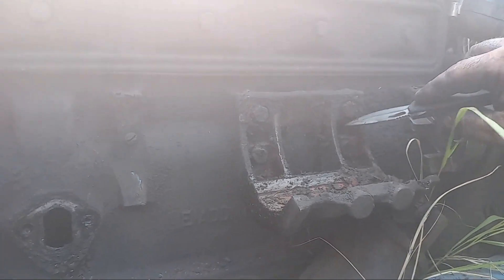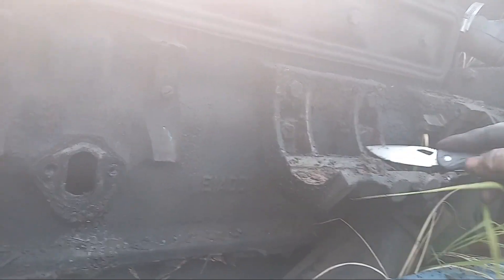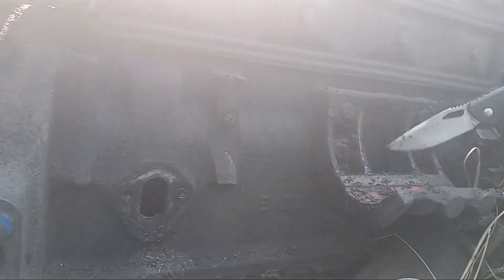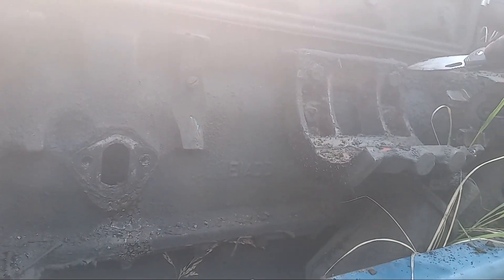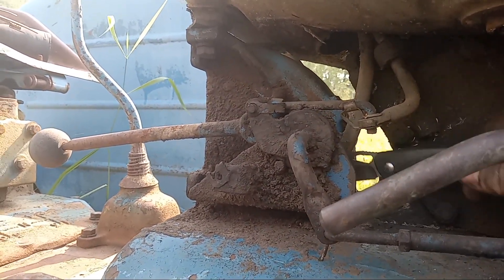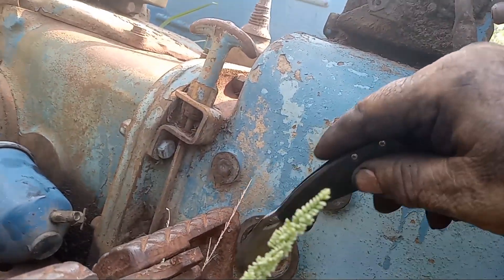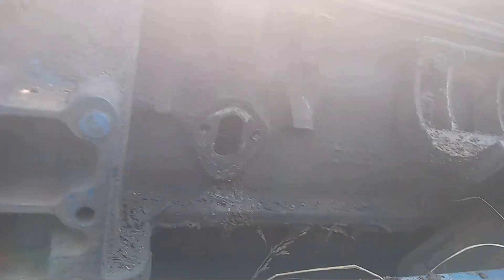You can check the specs on that. That's what gives you more power on a Power Major. There's a possibility that between the Power Major and Super Major eras they may have changed the gearing in the two-speed box. The two-speed box is underneath behind the steering box - that's the shifter tower, and the cross shaft for it is in the side. I don't know exactly if they had varying ranges in the two-speed, but I think they might have, because some of the tractors I've driven seemed to have slightly different gearing.